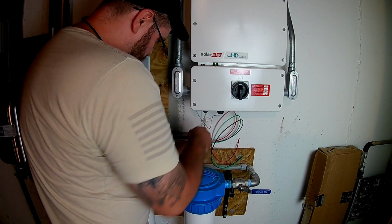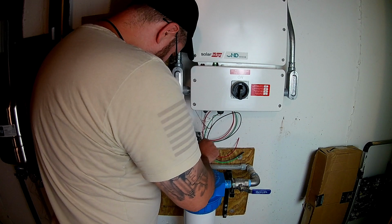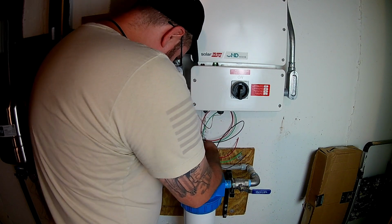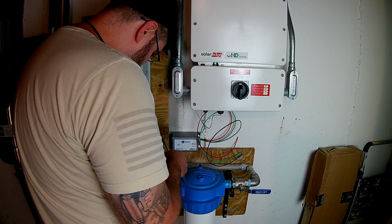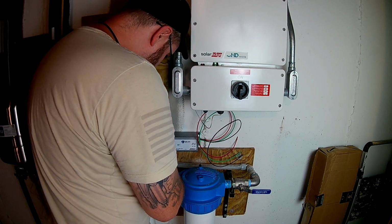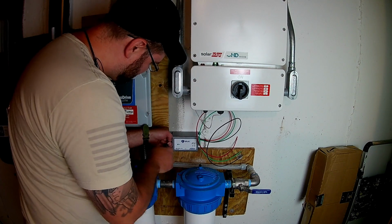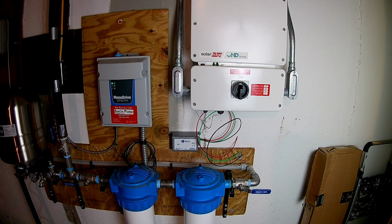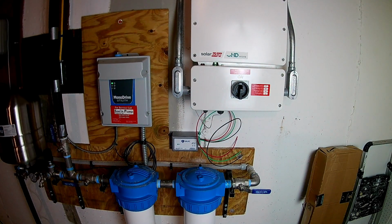The EMP Shield, I wanted to go with it basically mounted to something other than the inverter. That way, if any service to the inverter was needed, a replacement, it was just a quick disconnect. And I used the gray conduit that you use when installing a heat pump for the electrical to that. So basically, from the electrical box to the heat pump, I used what was left over from that because I had extra. So it just made sense to me to do it this way.